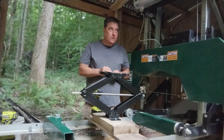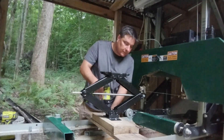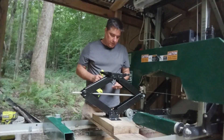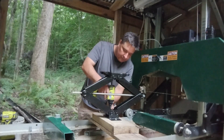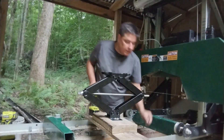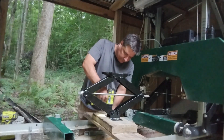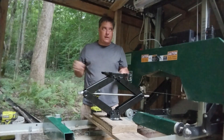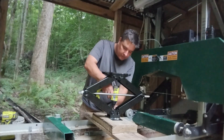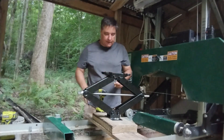Now while I do this, I want to talk about screws. These are the star bit screws. I've always hated Phillips head screws — they strip out real easy, especially if you take them in and out more than once. I started using star bits when I built my deck for the camper and I'm very happy with the way they work. I have zero trouble out of them — I can take them in and out quite a few times if I have to. Like when we moved the camper, I had to move the deck and just took the legs apart and moved it and set it back up in no time. If I had done that with Phillips head screws, inevitably one or two would have stripped out on me, and then that would have been a fight.